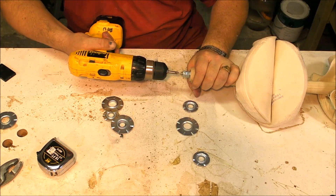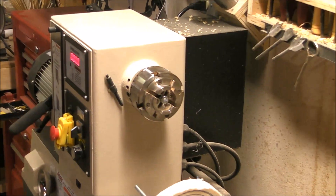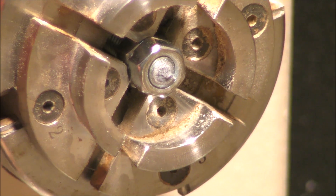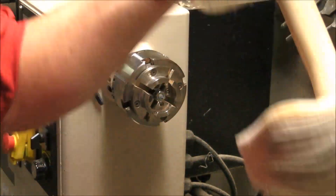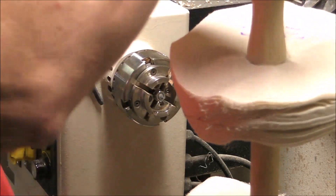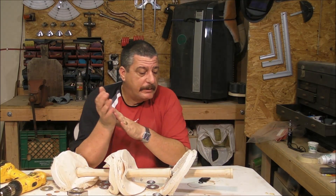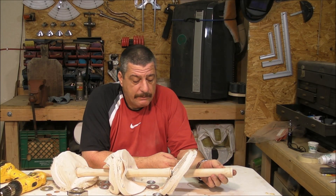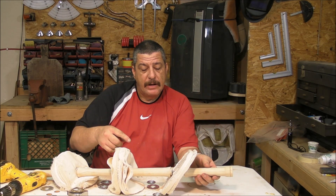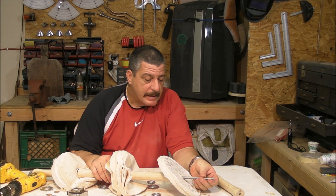It looks perfect. Then we make a hole on one end to use the tailstock. But when I mounted it on the lathe for the first test, the vibration breaks it — absolute failure. It looked very nice and the idea seemed good enough, but the vibration breaks the threaded rod. It was a little bit off-center, and with the weight of the discs that off-center grows more and more, breaking the threaded rod. This one ended in failure.